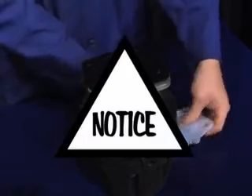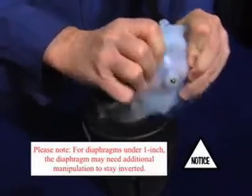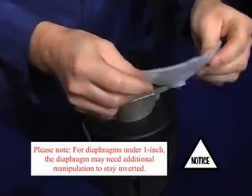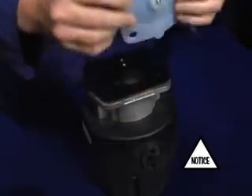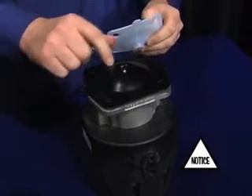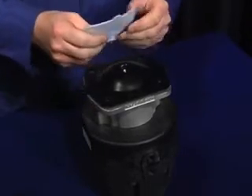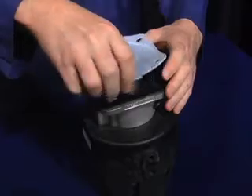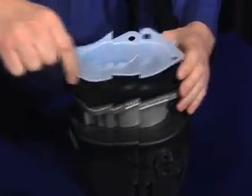To ensure complete thread engagement, invert the PTFE diaphragm by pressing your thumbs on the middle of the diaphragm while holding the edge of the diaphragm with your fingers. Also, it is important to invert the diaphragm so that it is not rubbing against the backing cushion during installation. Once the diaphragm is inverted, engage the threads of the diaphragm with the tube nut and begin rotating the diaphragm clockwise.